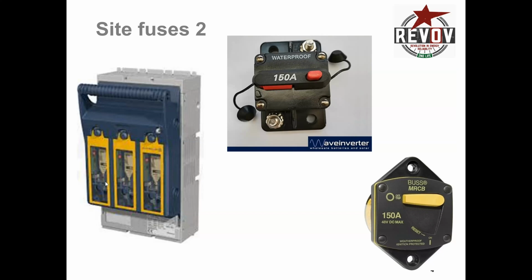If you have multiple systems and you want to put in some bigger fuses, which a lot of people do, then this is quite a neat and effective way of knowing that you are going to upgrade the DC system with another set of batteries later on. You can put in a system like this, and then all you do is swap out those little fuses from a 125 to a 250 when you put in another battery set or another 2 battery sets. Still, I would much prefer a DC switch.